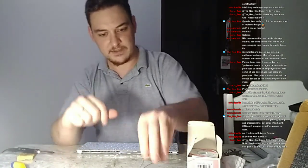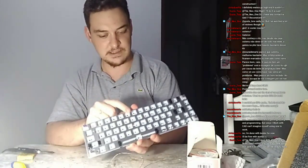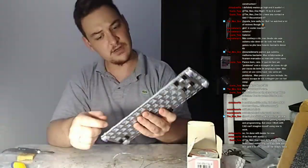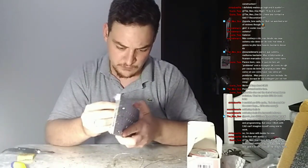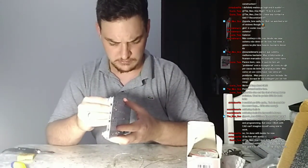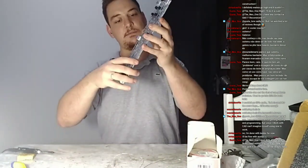Okay, awesome. Okay, so let's go for the rest of them. As I do it, I like to avoid the bending. So what I'm going to do is solder one right at the most bent place of the PCB, because that really corrects the bending over all the PCB.